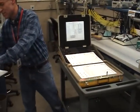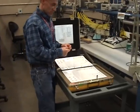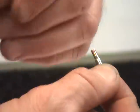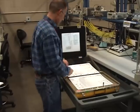MS3476 — what I want to know is what size wire and what size pin I'm going to use. The pin itself has a color code. In this case it's brown, brown, blue. If you remember from resistor color codes, brown-brown is 1-1, and blue is six. So I know instantaneously it's a 116 pin — something dash 116. I know I'm on MS3476, and I simply go down and look for 116. I get 116, and this connector shows 39029 — that's a manufacturer number, slash 5-116.